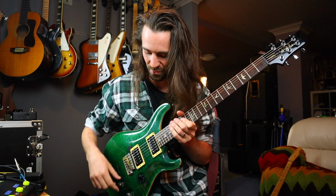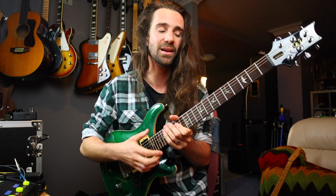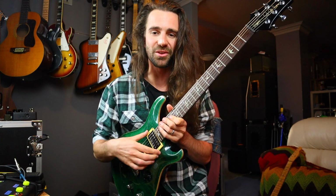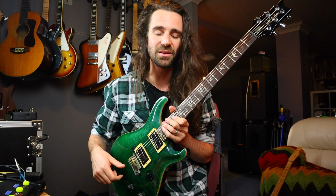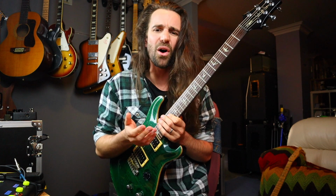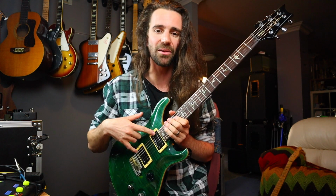And then if I click one more, I have the inner coils in parallel. And finally, I have the bridge humbucker in series. So this is really clever in my opinion. It gives you a best of both worlds thing where you get, on the extreme positions, your kind of classic Gibson style humbuckers. The in-between positions give you that stratty thing. And the middle position, which I think is super underrated, gives you like a more idealized, usable version of the classic 2 humbuckers in parallel thing.